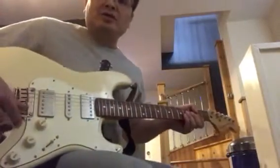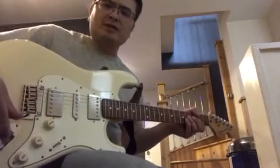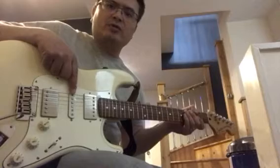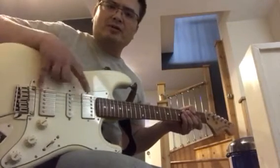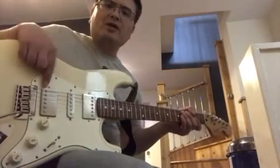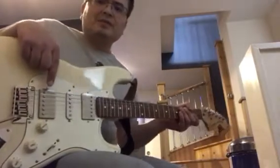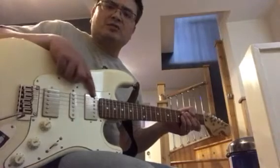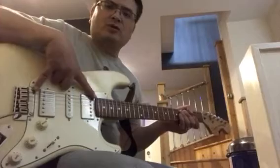So I'm using a 3K resistor to ground when I split my humbuckers. And that basically means that this single coil here is about 6.2 kilohms DCR. The humbuckers are 8.5 and 8.2 DCR respectively. But when I split using the 3K resistor, this one splits down to 6, and this one splits down to 5.7 or something like that on the outer coil.